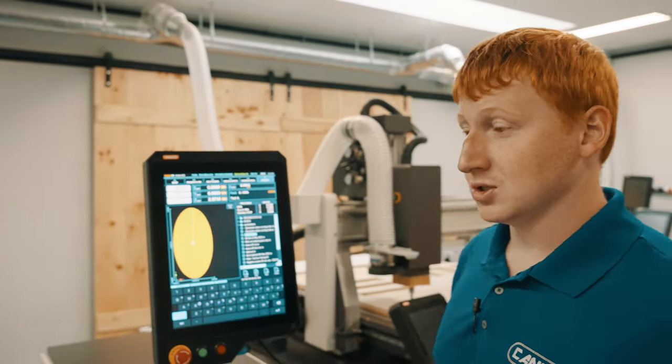Additionally, you have a spindle override command here, and you will see that you can both increase and decrease the RPM. Typically, the spindle override command is used when your tool bits are getting dull. You can increase the speed of your tool to help that tool last longer.